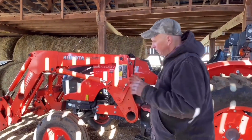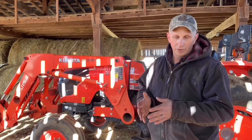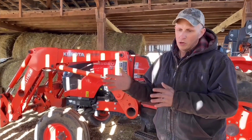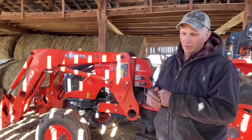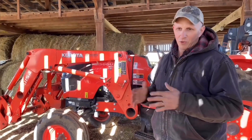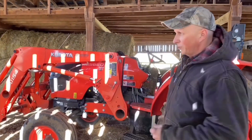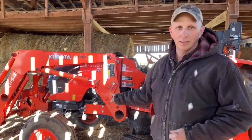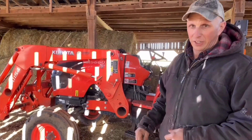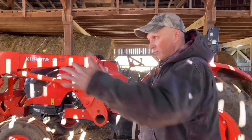And one more thing, if you ever want to buy an old tractor, there are people that love them and people that hate them. I grew up on tractors that had tricycle front ends, the narrow front ends. Some people say, oh my God, those are the most unstable things there ever was. I'm a fourth generation farmer, and we used those until I was 30 years old, and we never had an issue with a tricycle front end tractor. You just have to know that right under here is a pivot. Well, if you're on a hillside so steep that the pivot makes a difference, by the time the tractor catches up to that pivot, you're probably too far gone anyway. Now with the wide front end, if you're on a hillside, it may help you a little bit to keep from scooting the front end around the hillside.